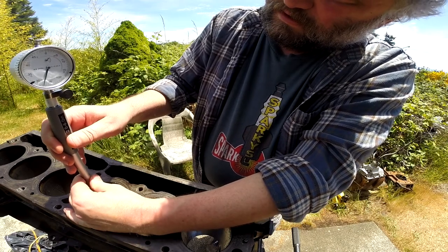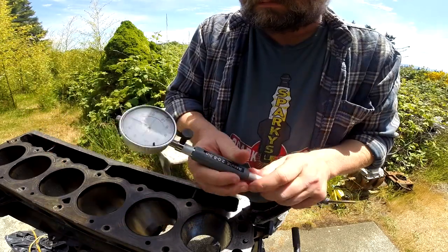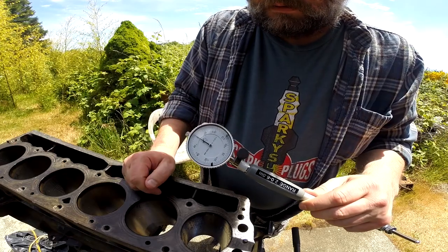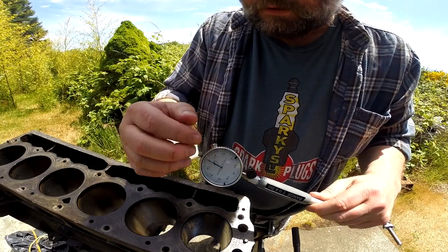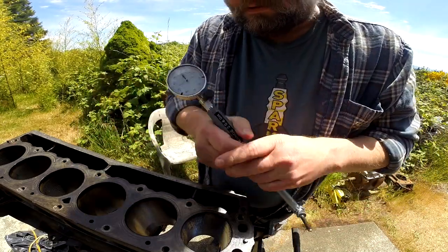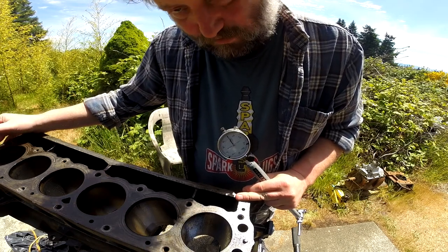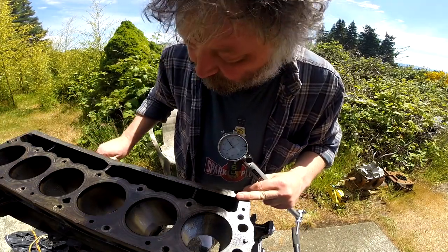This one's a little different. The other thing that was blowing my mind is that initially I was thinking the dial reading was adding to the dimension, but it would only be anything to the left of center that would be an increased size. So I need to subtract the numbers I'm getting from the base measurement. Anyway, that's the update for now. I hate the baby steps thing — I'd really like to know what I'm dealing with. I also want to get on parts ordering and inventory of the stuff we've got, and start ordering up some parts to put this thing back together.